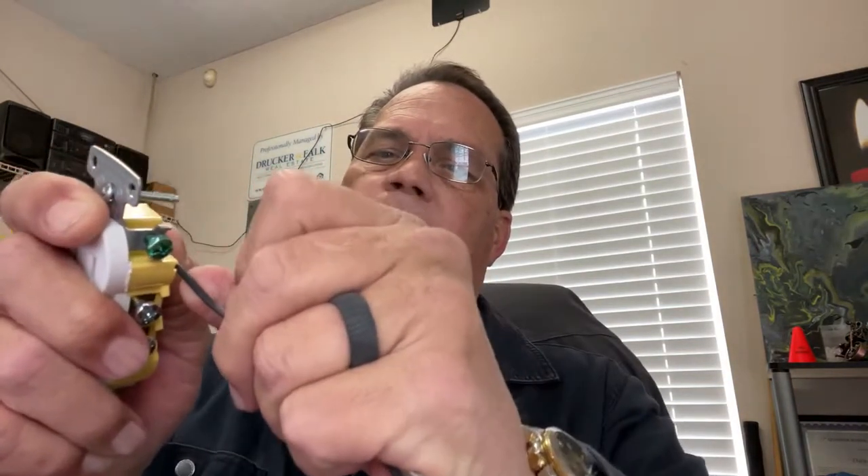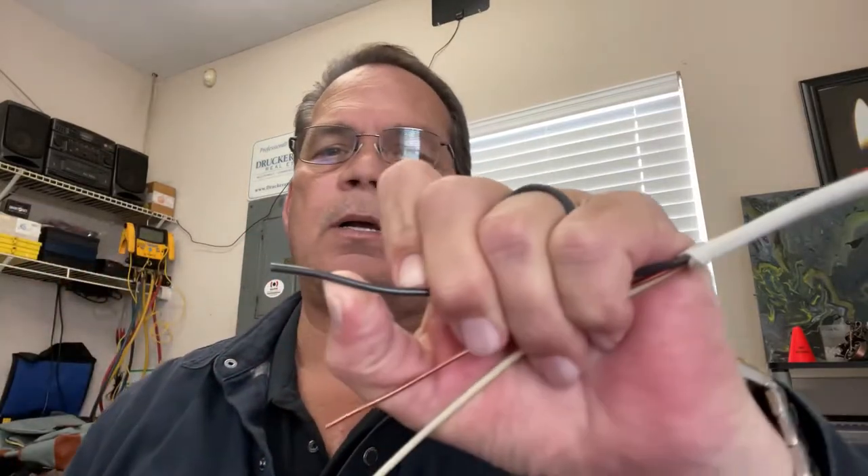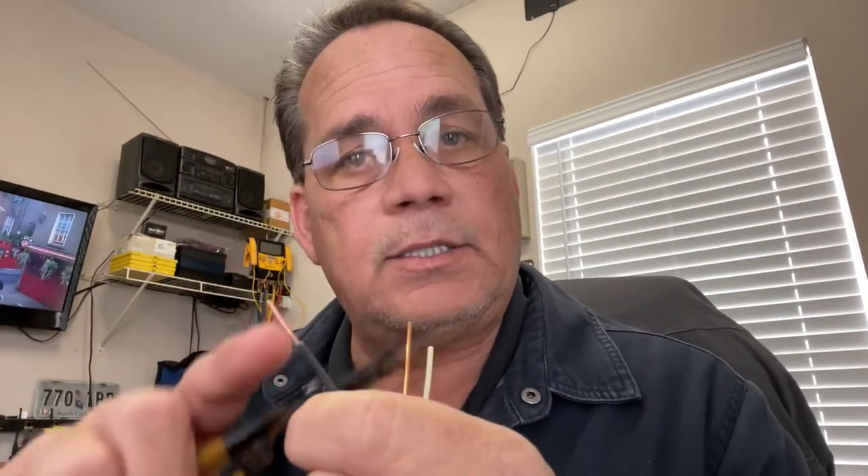So what you would do is just line your wire up to that piece. Put your thumb right there on that mark. Then get your wire strippers, find the correct gauge wire on your strippers that you're stripping back, and voila — that tells you exactly how much insulation to take off of that wire.